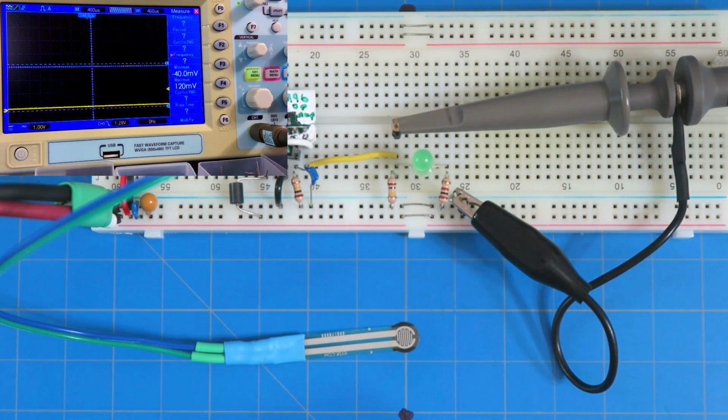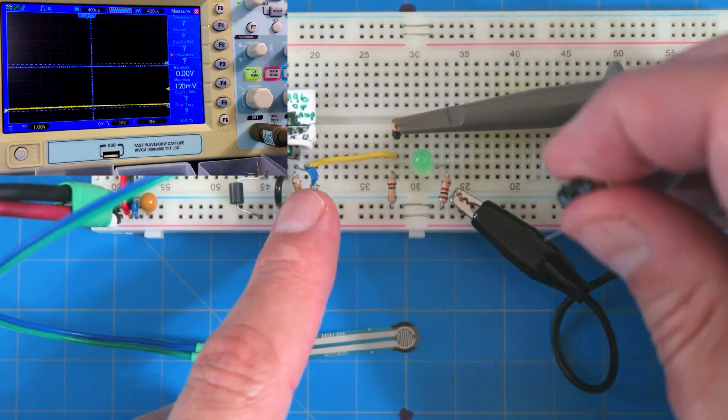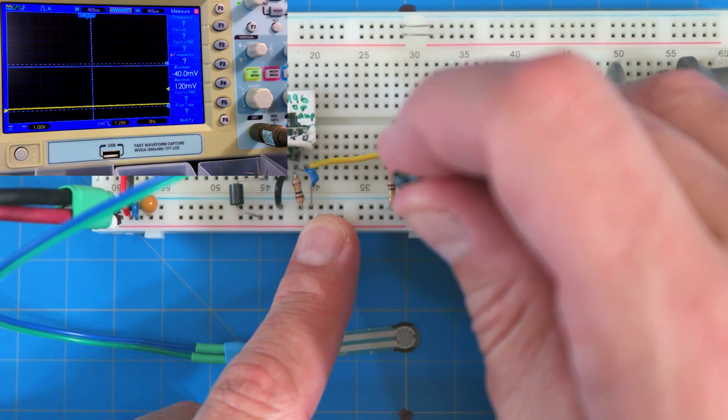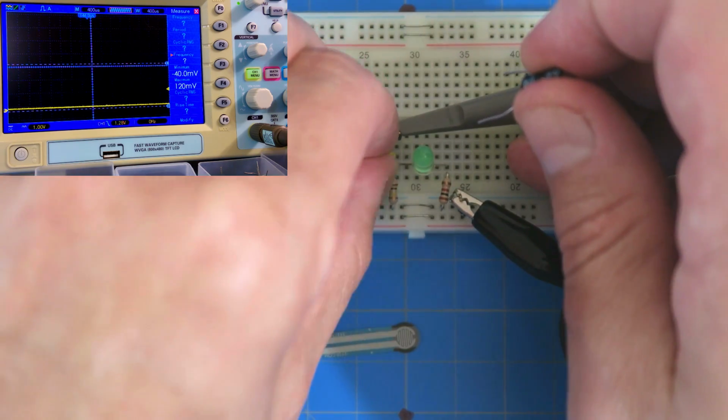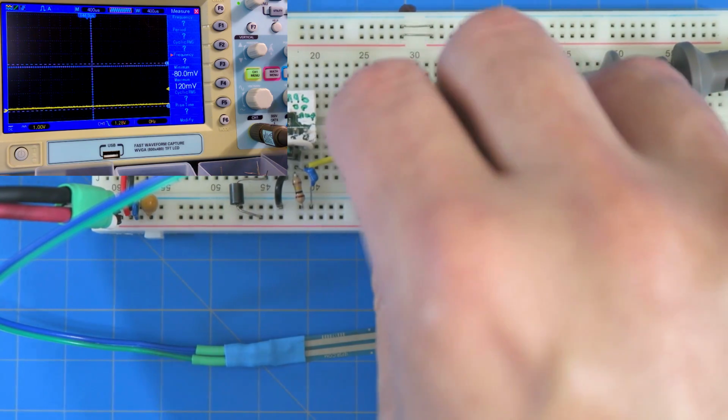Let's put in a 22 microfarad capacitor, which I just happen to have here, and let's make a filter. This will charge each time, and it's going to slowly discharge, right? So we're going to put that right here at this node. If I can get it in here, let me see. Never enough room. We'll make some. There we go, to ground.